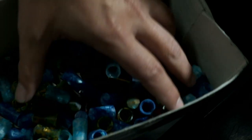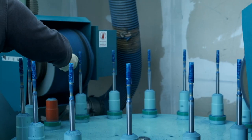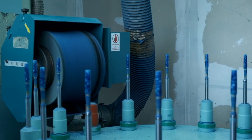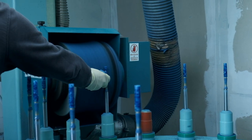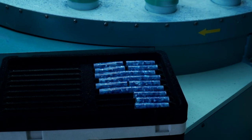This way the angle is exactly the same on each and every pen. Once the material is cut in the right shape, it is polished. This is done by spinning the brush and turning the pen parts at the same time, so that an even, perfectly shiny surface is achieved.